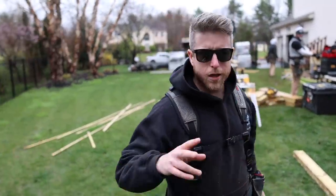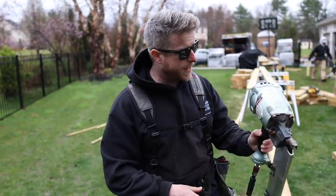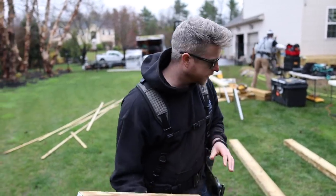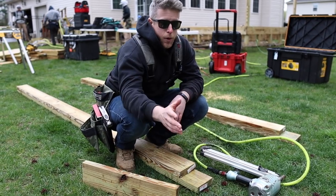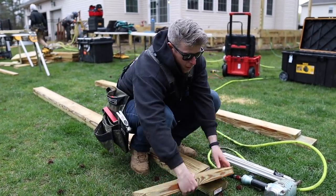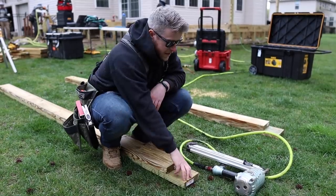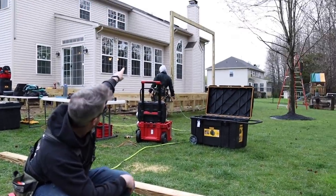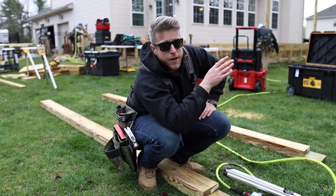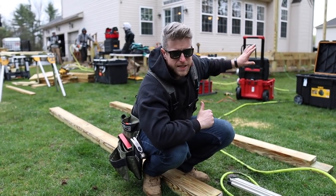We have one side of this pergola-style structure — it's not really a pergola, it's an anchoring point for our shade sail. We're building the other arch on the other side. The whole design is built so we can wrap it with standard five-and-a-half-inch deck boards without any weird cuts. We have a double two-by-six acting as our post and the same for the rafter. One piece is cut five-and-a-quarter less than the other so it can accept the rafter coming across, giving us a nice anchoring point. To give it lateral stability, there will be railings tied into it and a bar — anchored into the deck with the bar and railings connected, it'll be stiff enough to accept that shade sail.